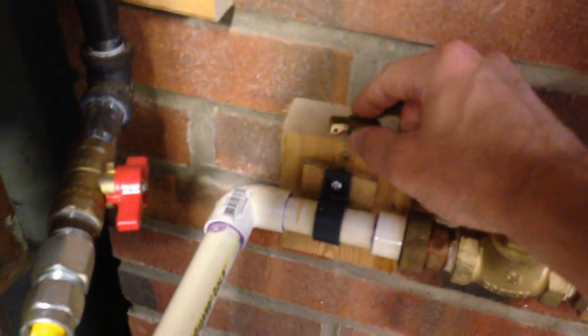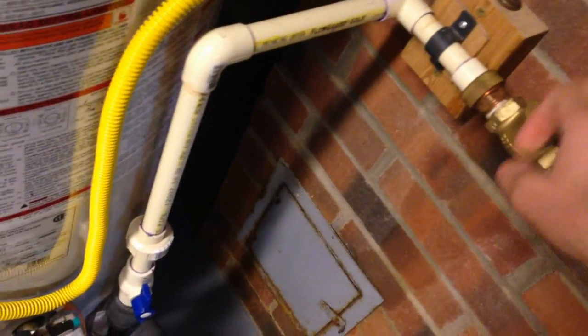I put the valve back together — there's the old swinger. How do I know it's working? The easy way to test: I'll turn the hot water on — I can hear it going down the drain. How do I know the swing valve is actually closing? Two ways to check. This pipe here is not warm — it's cold. This one coming from that side is not warm either. But this pipe coming out of the hot water tank is scalding hot — the copper pipe is hot. So I know water is not coming out from the wrong place.